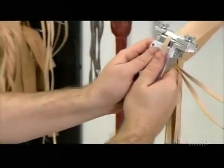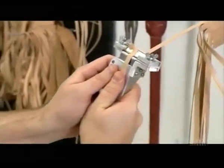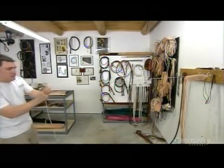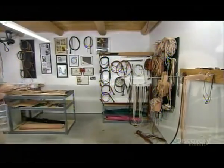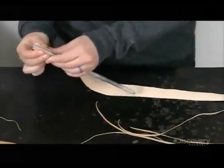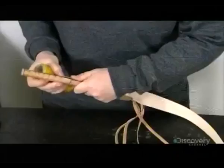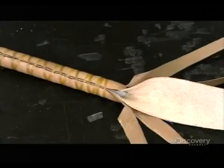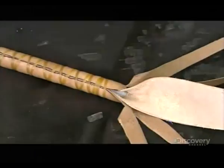Using a tool called a hand splitter, they shave the backside of each strand to a uniform thickness. This prevents lumps in the taper of the finished whip. Next, they take waxed cord and tightly bind a tapered strip of leather around a handle foundation. The leather strip, called the core, will extend into the center of the thong. They attach the first belly yoke over the handle and core, then braid the strands to begin forming the thong. This compresses the core into a solid round center.